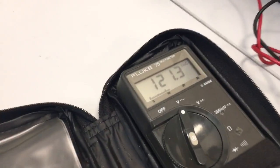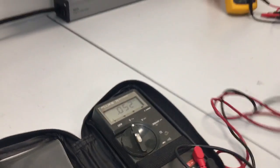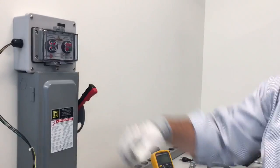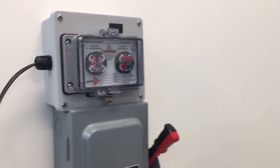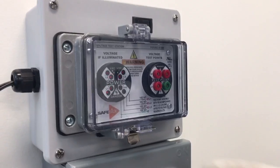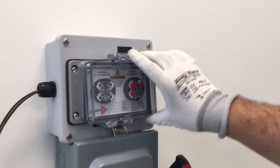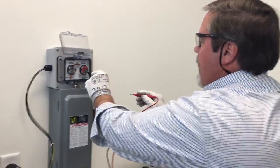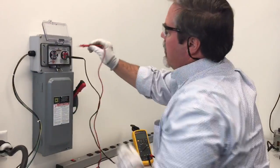It is reading voltage. I'm going to come out and start the job. I'm looking at the voltage indicator — I see that it's flashing on L1, L2, and L3. That being said, I'm going to go ahead and open up the cover. I check my meter — my meter is working. I'm going to start by measuring phase to ground.